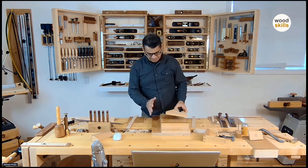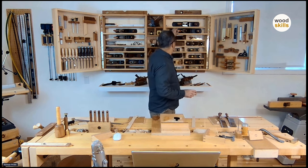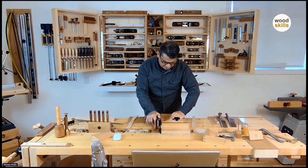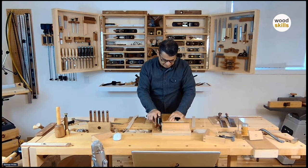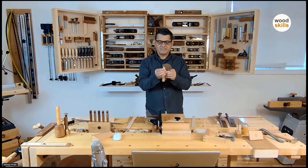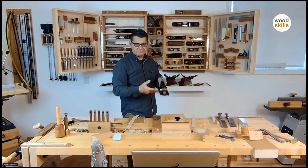The difference with mine is that it comes with attachments — this one does 45 degrees. You bolt it down and use it for 45-degree cuts. I need to readjust the depth of the blade — it's a little too thick. Once adjusted, it gives a clean 45-degree cut. If you're building a basic shooting board, you can use one of your existing long-sole planes.